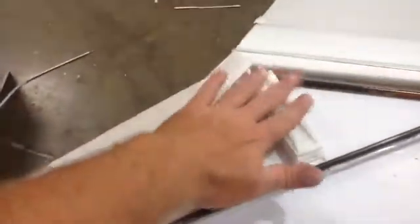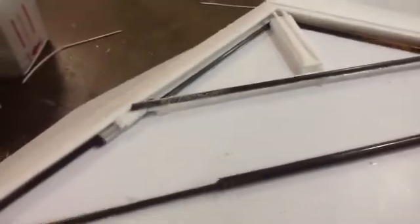Here's the wing with the airfoil on it. Not glued yet. I still gotta put servos in. I used a hair dryer on this to really make the crease nice and smooth. And here's my air shafts. I built up the middle part, give it the support. So air shafts are in, support's in. Next thing to do is work with servos.